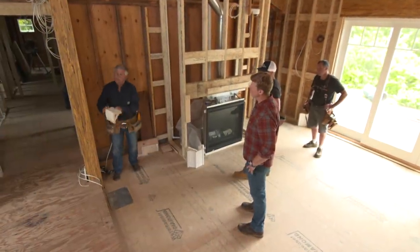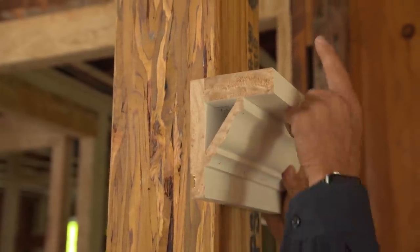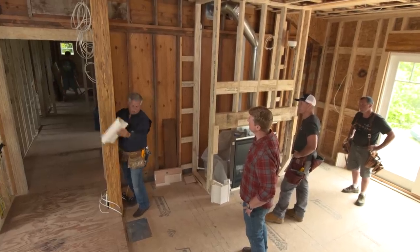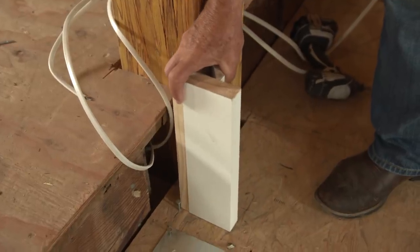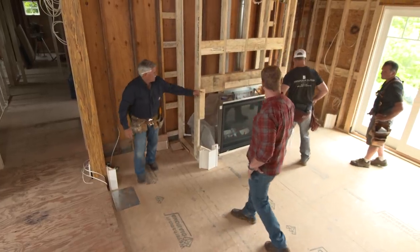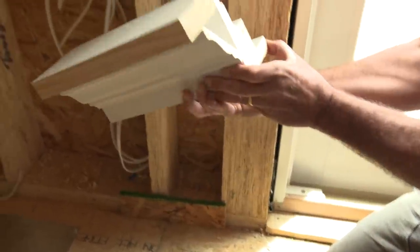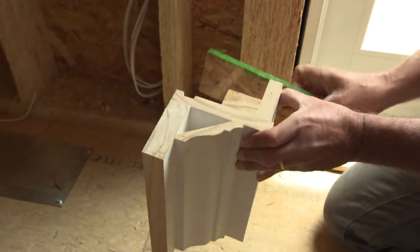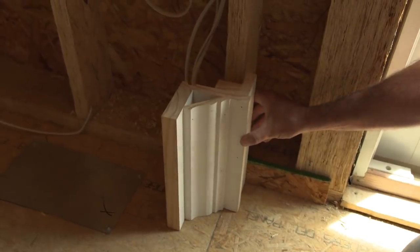Now this piece here represents the piece that's going to go along the side of that beam. There's going to be another one on the other side, and then we'll fill it in with a piece of finished trim. We place that right on the floor, just like this, in the orientation that it goes. So that's our left edge in this room. On this side, we're actually going to step it off to create half a beam off this wall. We've simulated half an inch, which is our drywall, and then the half beam, which goes like that.